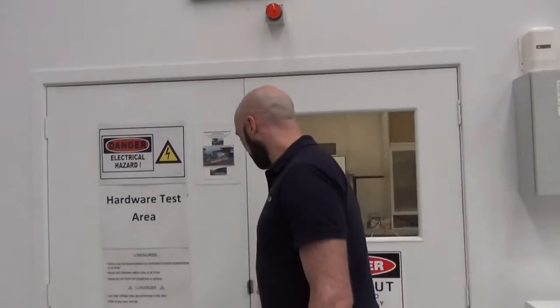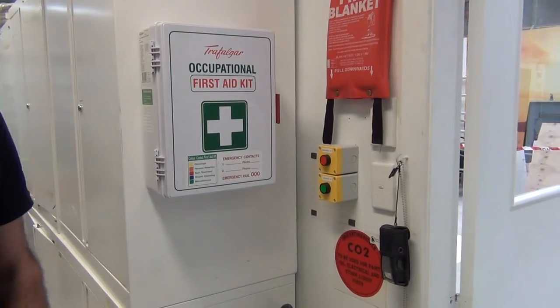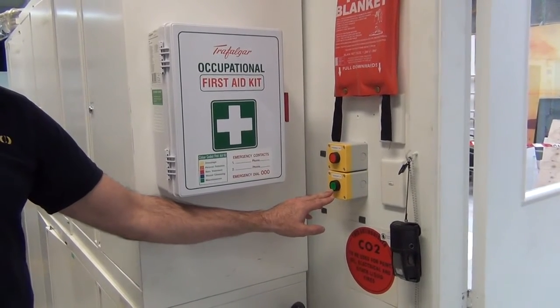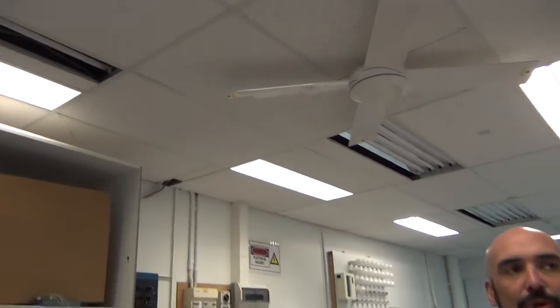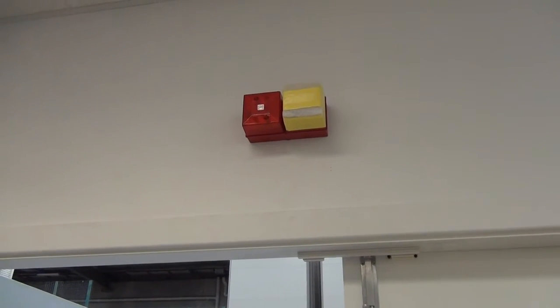Taking a look inside the room, we have an emergency stop button intended so that anybody inside the room will be able to very quickly turn off the lights by pressing it. We have our first checkpoint button — this is one of four. When the system is in the arm position, this button will start glowing green to indicate that it is ready to receive the checkpoint response. We have network sensors automatically monitoring the room and seeing if there are any occupants within the space. The doorways have reed switches on them so that if anybody opens the door, it will immediately turn off those lights. We also have mounted above the door additional warning lights and a siren warning occupants that we're running the UVC cycle.